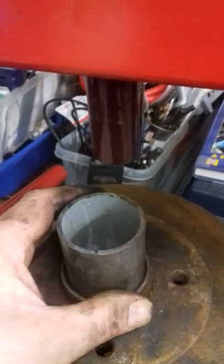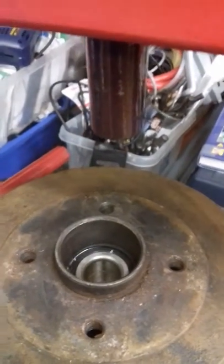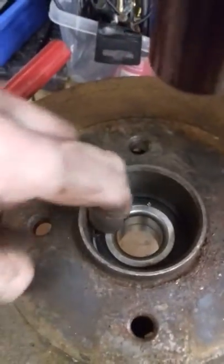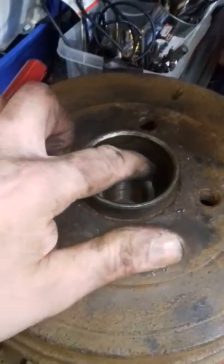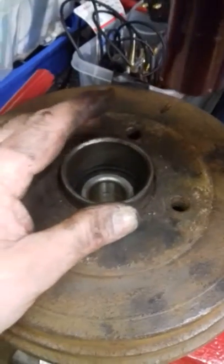Basically pull out the tube and then you can get your circlip pliers and fit the new circlip down there. As you can see, it's in place. Even though you needed several tons of pressure to put the bearing in, the fail-safe is this beautiful little circlip there.